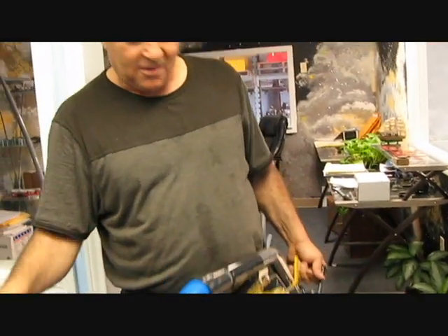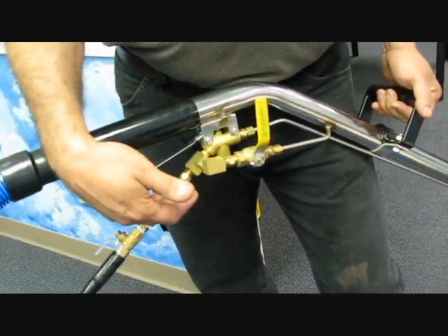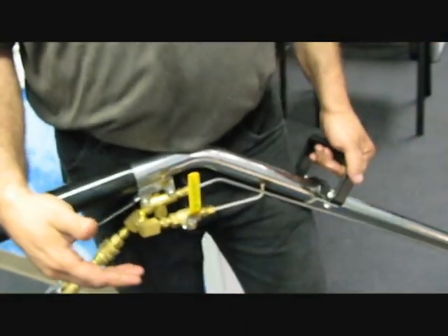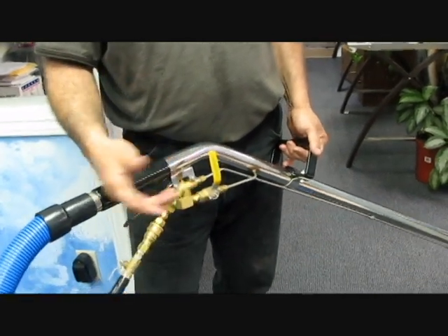This is an old system that's been around — because every time you move from one house to another, your water inside your hoses gets cold. Why not have a valve to serve that purpose? You can get the hot water to roll for you quicker, and also if you ever want to put the wand down for an extended amount of time — let's say 5 or 10 minutes — it's good to open it and allow the machine to start discharging heat back into the tank.